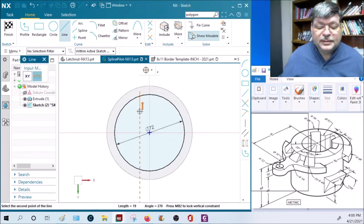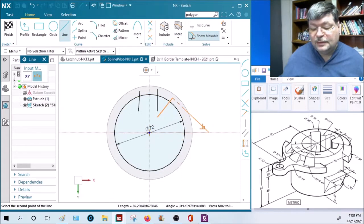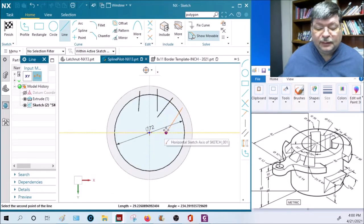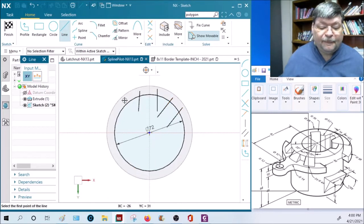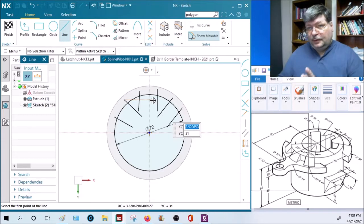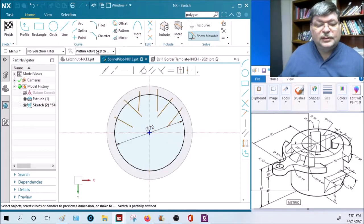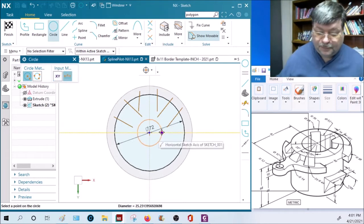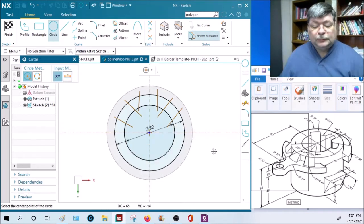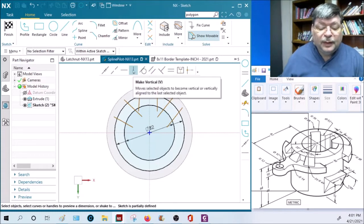We're going to put in the sides of the top hole and some other lines. These sides do not go through the center point - they are parallel, so we can put that constraint in. You could just do one of these toes, like the center one, and do a pattern of two, then mirror to the other side. Or if you want to sketch them all out for practice, do all the sketching. The center hole is 52 diameter.